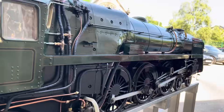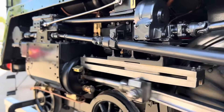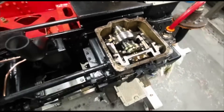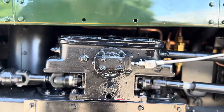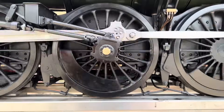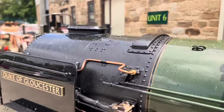The full-size prototype that this is a model of — the Duke of Gloucester — was essentially an experimental locomotive with rotating camshaft valve gear: Caprotti valve gear. Much more complicated than Walschaerts or Stephenson's or any of the more common valve gears, but allowing for full pressure to be injected into the cylinder. If you look inside that valve chest — I cut here to an earlier video we did before the boiler was back on — you can see the complex series of cams and followers that drive the poppet valves going up and down, opening cages to admit full pressure into the front and back of the cylinder. Following the rotating prop shaft forward through a 90-degree gearbox you can see the valve chest above the third middle cylinder as well. Caprotti valve gear allowed for increases in performance, power and efficiency, but it came too late really — fitters were used to working with Walschaerts and Stephenson's valve gear, and steam was toward the end of its life, so it never really got the chance to be developed into the success that it could have been.